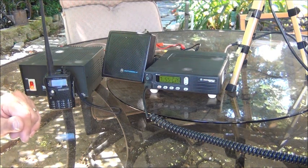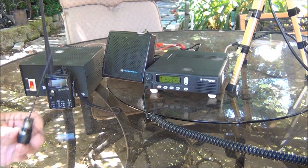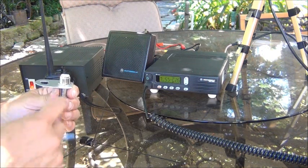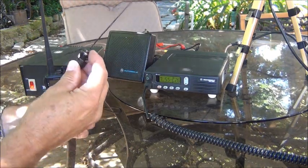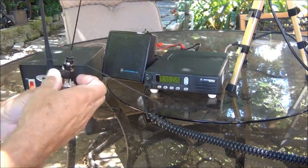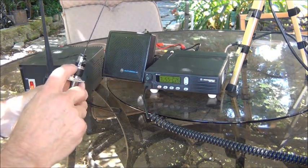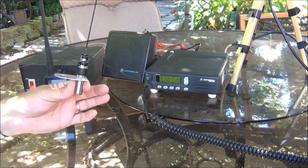I did want to show one other thing. Remember I talked about the SO239's ground planes normally being drooped or tilted down a little bit. Here's another variation of a ground plane antenna. Normally people will have an SO239 with four screws at the corners with the radials coming down from it. This is a ground plane, but it only has two radials, and it's hooked onto the PL259 connector rather than on the base. So you can just plug this into any SO239 and it would work. I could only use two radials in the place I had this hooked up.